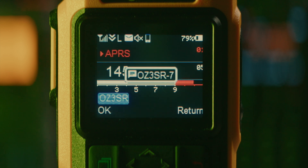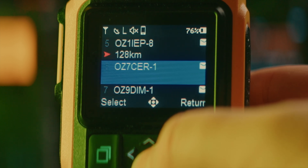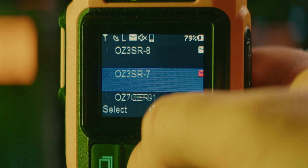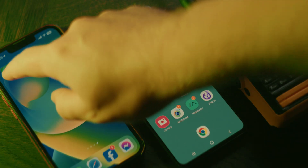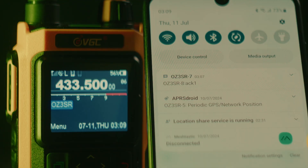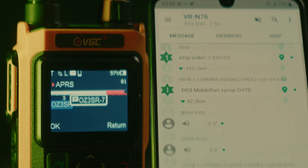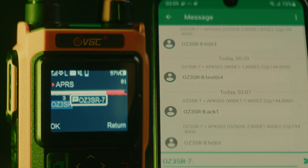This radio is so close to being really good, and while everything technically works, I still think there are a few problems that should be fixed. When receiving an APRS message for your callsign, you get a pop-up on screen but it would be nice to have a sound alert as well, like on my Kenwood D72. The messages are all put in the same big list of beacons, so they're quickly lost in the sea of APRS activity — it would be nice to have a dedicated page only for direct messages. Also, if you receive more than one message from the same callsign, it only saves the latest message; a chat window with message history per callsign would be much better. If you are using the iOS app, you won't get any notification about direct messages. The Android app will display a notification and play a sound, but you have to tap the notification or look through the long list of APRS activity to find the message. The app has no dedicated area for direct messages, and it also shows receive acknowledgments as individual messages.